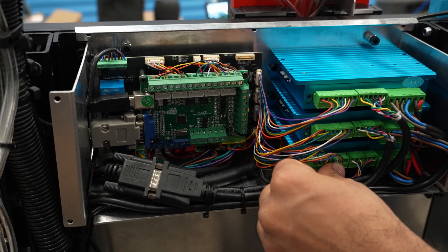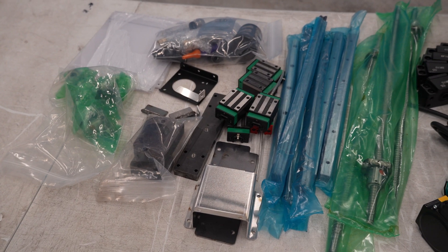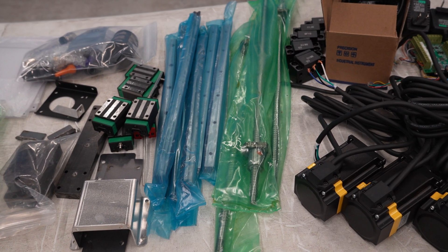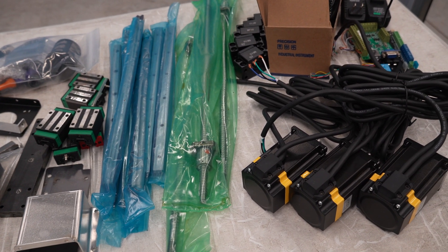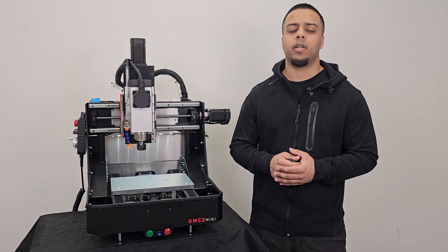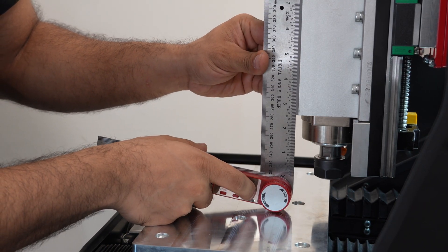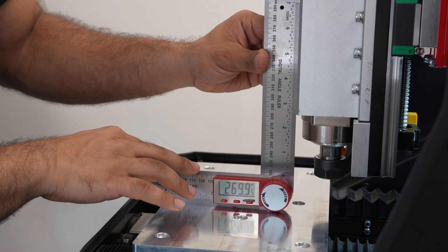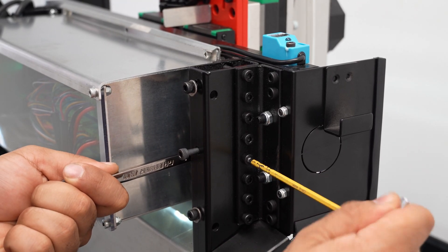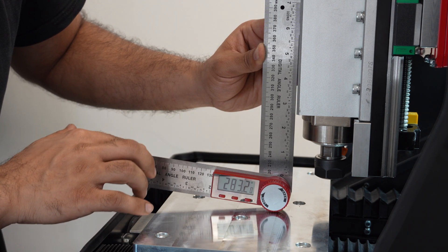With all of these ease-of-assembly improvements the process has gotten a lot simpler and faster, but I don't want to oversell that and make you think this is a quick couple of hours assembly. There is still no escaping from the fact that there are six rails, three ball screws, three entire axes of moving parts, and some 50 or so components overall that need to be assembled — so this build will take you on average about two to four days to complete. You can most likely finish it over a single weekend, but budget for a little more time if you need to start cutting urgently. An important upgrade that speeds up assembly is the tramming system built in, so you can put the entire frame together without any concern for accuracy or alignment, bolt everything together as it naturally wants to align, and then worry about tramming everything once the machine is completely built.